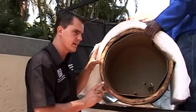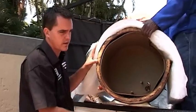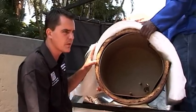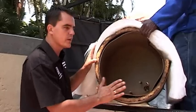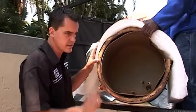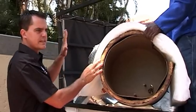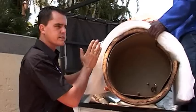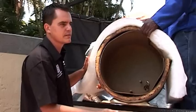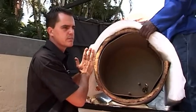In the summer months, roof temperatures at night fall quite a lot, so you still have energy losses and heat losses during the evening in the summer — and that's when you're actually showering and bathing. That's when the geyser blanket critically needs to do its job. You will never have an outside temperature of 60 degrees around your geyser, and that's why it's important to have a geyser blanket in place in both summer and winter months, saving electricity right through the year.